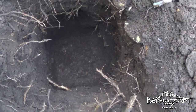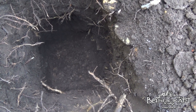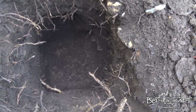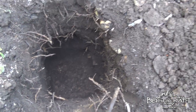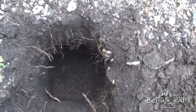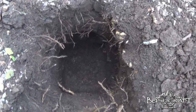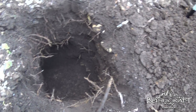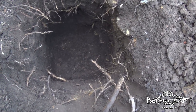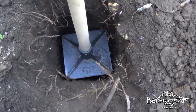The plan is to put a layer of gravel down and then concrete, or a layer of concrete and then gravel. I think I'm going to end up cementing these posts in after I get my subfloor on and I know they're plumb and the right distances. I don't want to cement the post in before I actually have my subfloor built. I'm going to watch a couple more YouTube videos to see the pros and cons. Then, after that sets, I'll put my post on there.